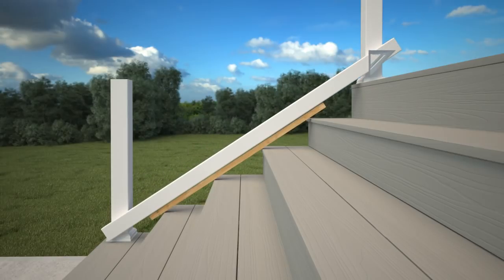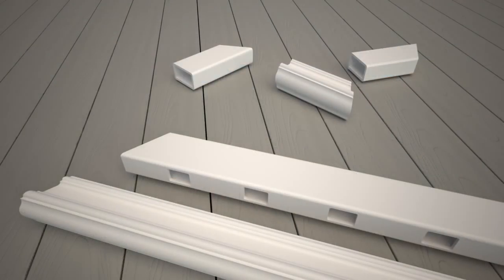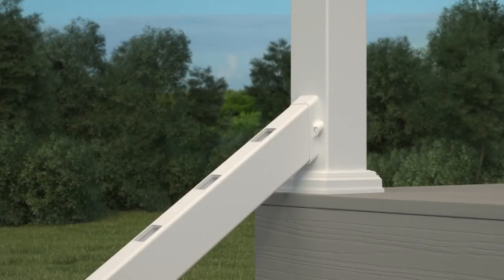Align the top rail with the bottom rail to ensure the baluster holes will align properly before marking the angle for the top rail and brackets. Cut bottom rail to proper length, then align the hole pattern with the top rail and transfer the cut angle. Insert the bottom vertical bracket into both ends for the bottom rail.